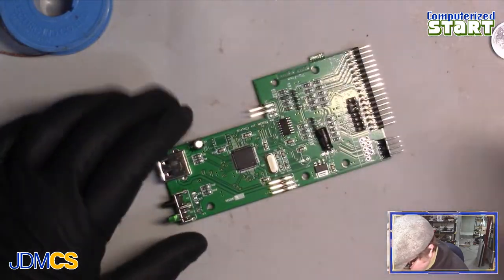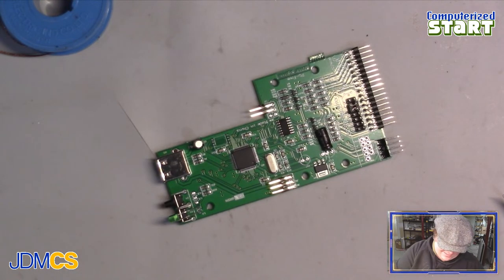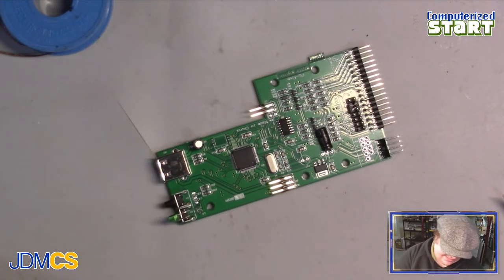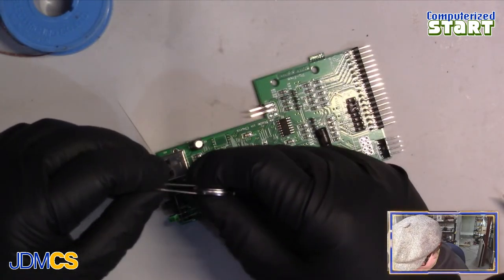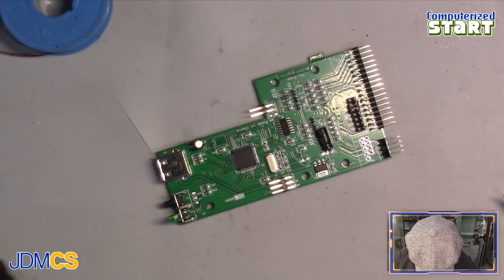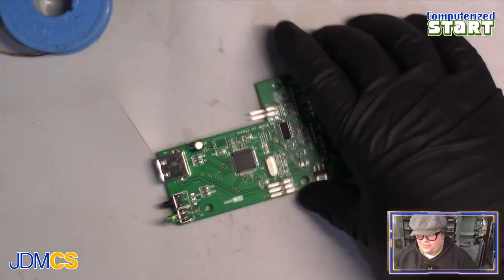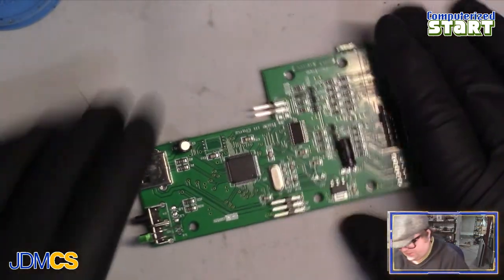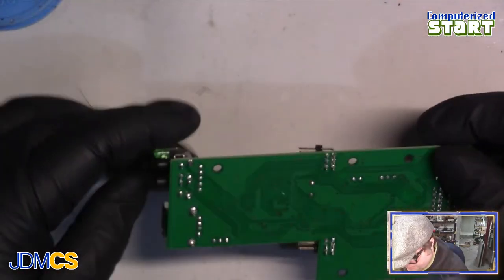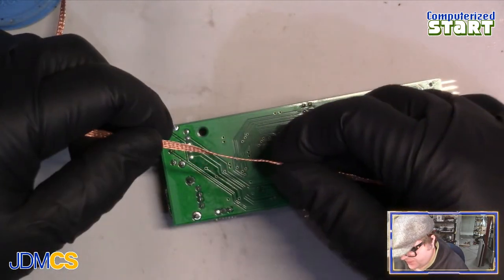There's jail bars on the screen, which isn't right. And the text is wobbly. So, yeah, that's why you haven't seen the video I wanted to do for DOS Ember on the Emerson 386, because I have had video card trouble in that computer. The video card that came in it can't support enough colors to run the software that I'm going to run for that video. And then every video card that I've bought to put in it has had something wrong with it.